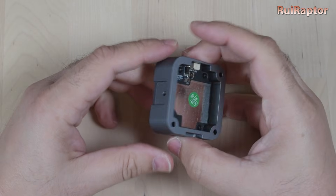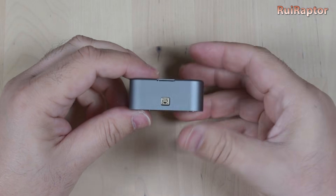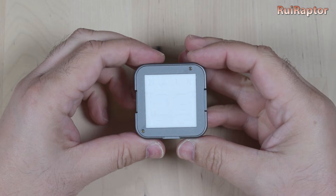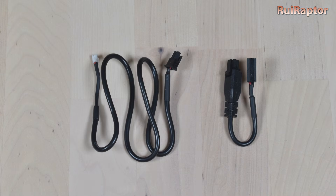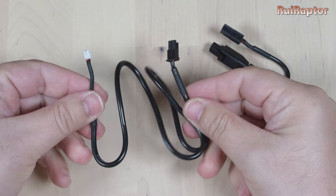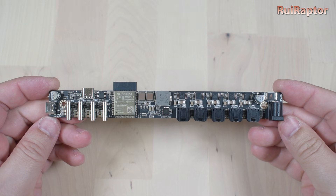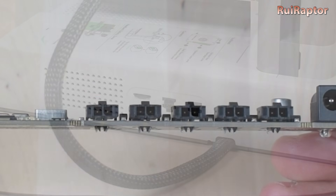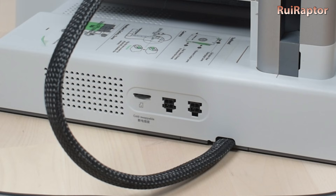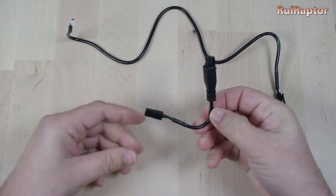The light module is where the handle will be attached to. It's all metal, and on one of the sides is the small connector for the power cable. At the top is the 3D printed relief panel, secured by a couple of magnets at the corners. The power cable for the light module is split in two — the first one can connect directly to the Panda Branch Plus, which can provide independent power to external devices. The Branch Plus uses two-pin connectors, while the printer uses four-pin connectors, so if we want to connect the light module directly to the printer, we need to connect the smaller cable in between.